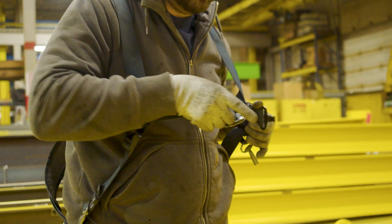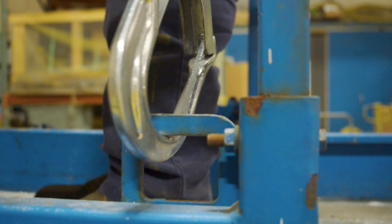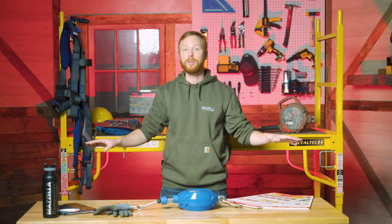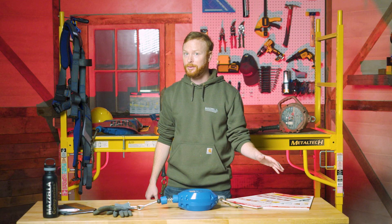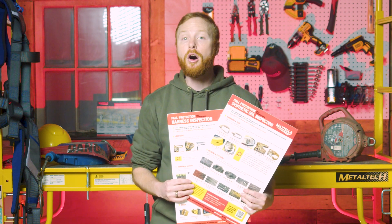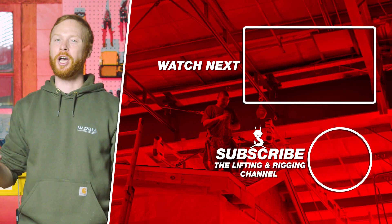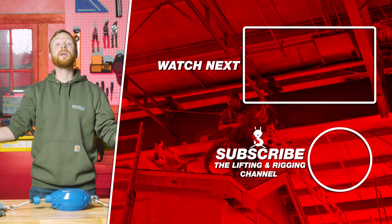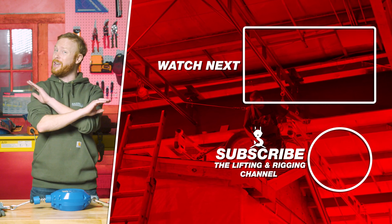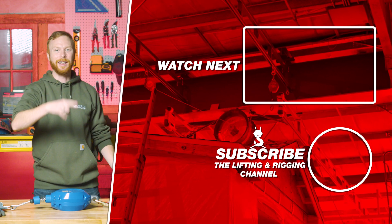Remember, you are responsible for your own safety. You need to inspect all of your fall protection gear before you use it. If you see anything questionable, don't use it — tag it as dangerous and get it repaired or replaced. We've created visual guides to help you recognize SRL, lanyard, and harness removal criteria, and you can download them all for free — find the links in the description below. Use them as a reminder every time you check your gear, and always follow the manufacturer's recommendations. If you found this video useful, informative, or entertaining, hit that like button, subscribe, and hit the bell so you never miss a video. Drop any questions in the comments so we can get you an answer.